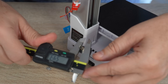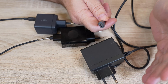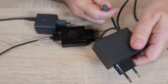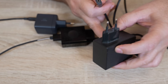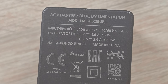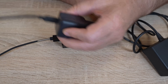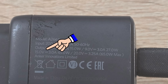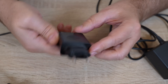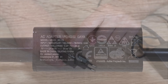I just checked — the size of this standard DC plug is 5.5mm, in case you don't want to use USB Type-C. Now let's talk about power. USB PD — power delivery — works so that this printer will ask for 12 volts. If the power adapter is not able to provide 12 volts, by default it will fall back to 5 volts, so you have to check if it supports 12V. First I wanted to use a Nintendo charger offering 5V or 15V — not good, I need 12V. Then I checked my wife's laptop charger — it supports different voltages but not exactly 12V. Then I checked my old phone charger with fast charging, and it has an output option of 12 volts and 2 amperes — which is exactly what I need. So I will use this one.